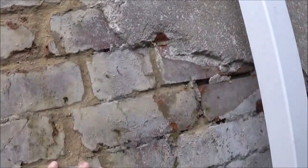I just want to show you this quadrant section. You can buy these for where you're making a connection, and they come with solid blanking plates all the way round. Cut out the ones you want to remove, just cut round the groove using a Stanley blade. So you just get your male groove and put it inside the female groove — like that. It's that simple and that's now connected. This is the same all the way down on these drains — you just connect one into the next. The only thing to bear in mind is if you need to cut any of the drains down to size, always remember to cut it the right way so you still leave the joints that you require. Because if you cut it in the middle and that's the end you needed to join, you've had it, because there won't be any connecting point.